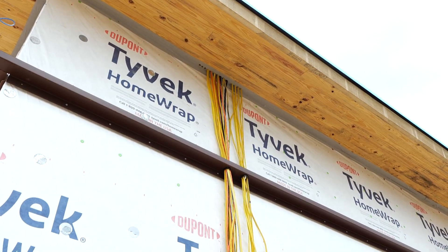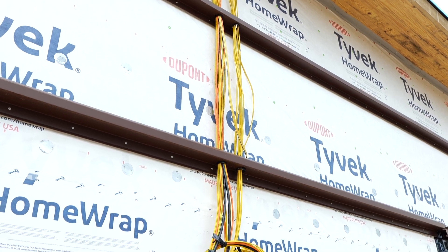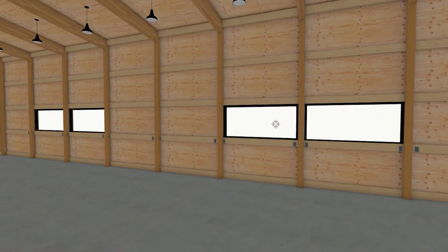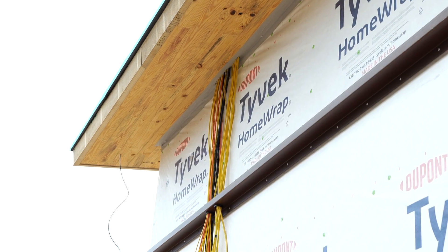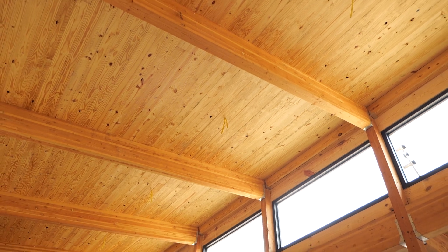Well, I'm going to take the mystery out — it wasn't really that hard. All we did is we ran all of our electrical on the outside of the building, and then brought it back in only where we needed. Walking through this rendering here, we've got our girders expressed, our 6x6s, our beams, and lights that are just poking through the decking. To get from the light switch over to those lights, we actually run outside of the building, up the wall, onto the roof, and over to the lights up on the ceiling. Everything is run external.